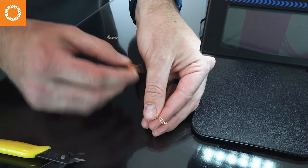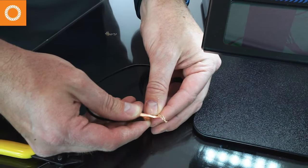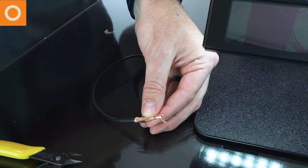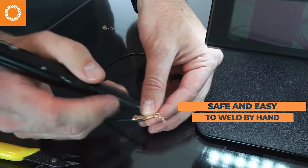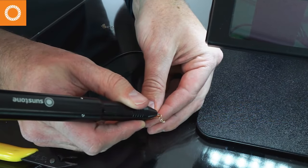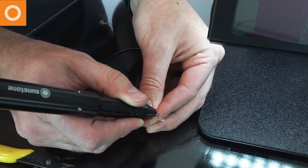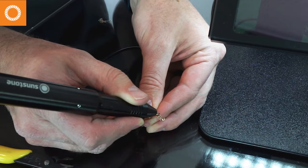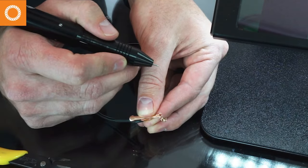Another option, especially when welding permanent jewelry on a client: clip your clip onto the link you're going to weld, then you can also weld by hand instead of welding behind the screen. Hold the stylus by hand, bring it up carefully, touch, and hold steady. Just that simple — this is right next to my skin with no damage to my skin. As for material selection, precious metals weld best — gold, silver, even platinum weld really nicely.